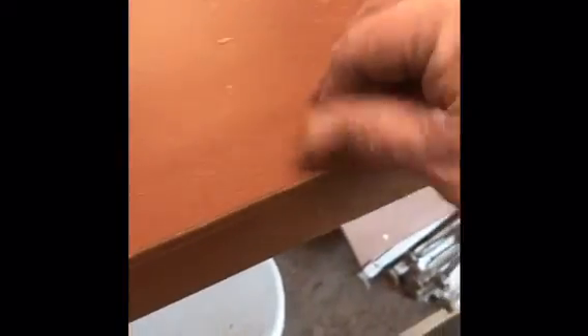Here's the finished edge — see how it doesn't pull up, nice and smooth, it's not sharp. It doesn't pull out and the corners are good and tight. I used a belt sander to break the edge as there was too much on there to handle with just the file. The trick with the belt sander is keeping the angle right and keeping it moving — don't let it set in one spot.